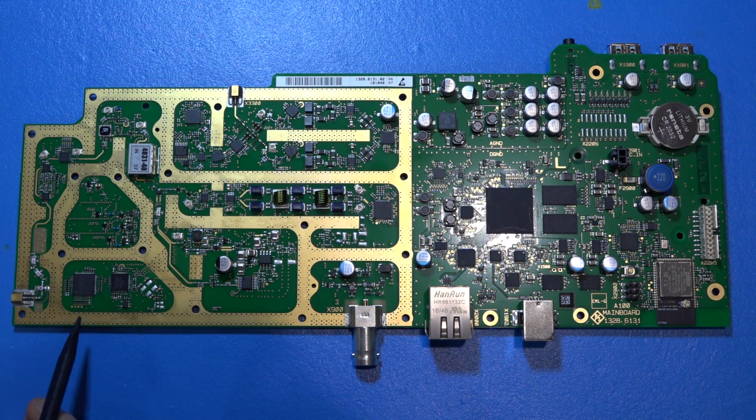So these two components, I don't have any data sheet for them because they're designed or at least labeled by Rohde & Schwarz, and they tend to do this because they're looking for a particular set of frequencies, some hopping frequency speed, some sweeping speed, as well as phase noise requirements, which they want to meet because that determines the performance of the entire instrument, and it is done this way. So we have a portion over here which has multiple sections, which is much more clear on the other side, to get a very clean LO generation, multiple filtering sections. We've seen this architecture particularly in synthesizers.